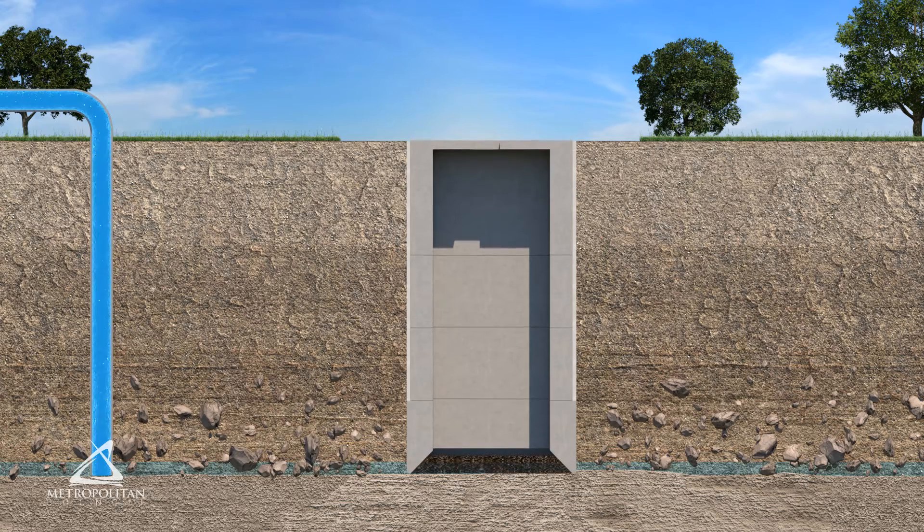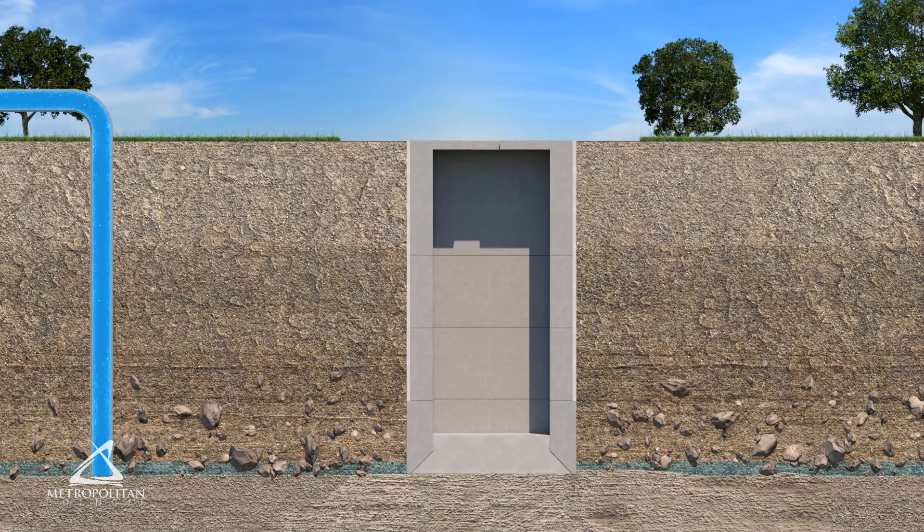When the desired depth is reached, a thick concrete slab called a tremie is poured into the bottom. The tremie stops the caisson from sinking, seals out groundwater, and adds weight to the structure. Without this additional weight, the structure could float. At this point, groundwater pumping is stopped.